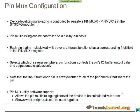For pin mux configuration, every pin can be controlled on a pin-by-pin basis. One important thing to note is that when a pin is configured, we'll receive that signal ungated. So you have to be careful — if there are other peripherals still running, even though you don't have the pin mux selected for that peripheral, they're still going to be receiving the input.